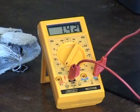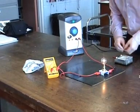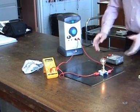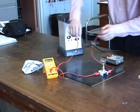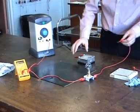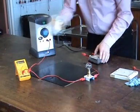Can I use both types of ammeter at the same time? Yes, indeed. Both must be in series in the circuit. You can imagine this as one large stream coming into the multimeter, into the light bulb, and then into the analog ammeter. I complete the circuit, being careful that the current is going the right way around.